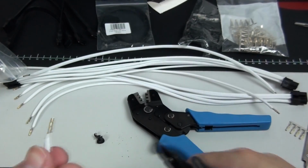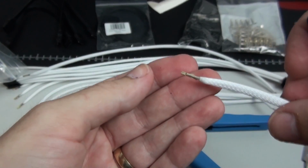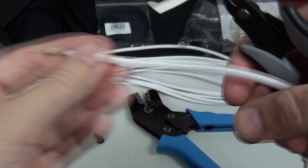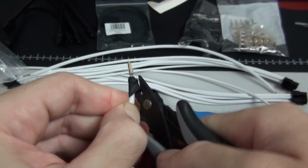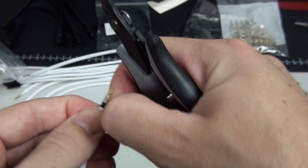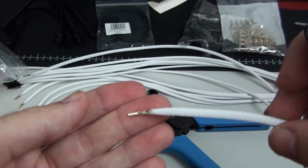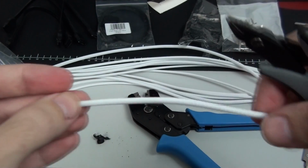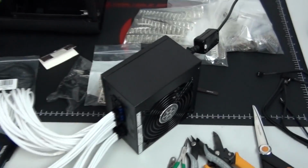And now you can see what I'm left with is a melted sleeving, and you can see it's melted because you can't see the individual strands anymore. It's approximately a 3mm strip, and this is incredibly durable, because where it's melted between the two crimps is the thinnest part of the pin, so it has to pull back over one of the crimps. It's melted into the crimp, it's melted into the insulation. It's not going anywhere. This is very durable, and you should always test it. So hold on to the pin, try to pull the sleeving back to make sure that it's very firmly in position.